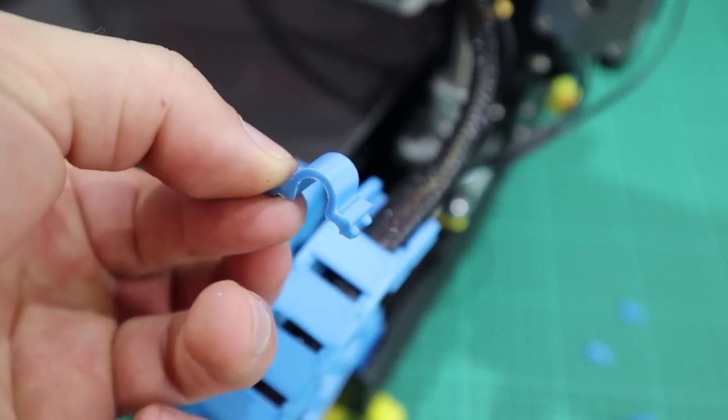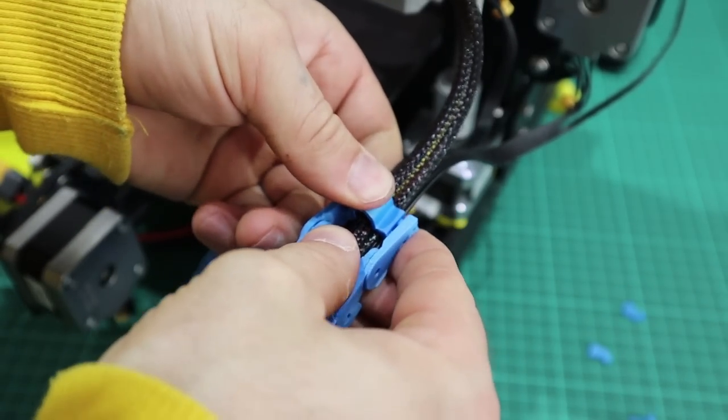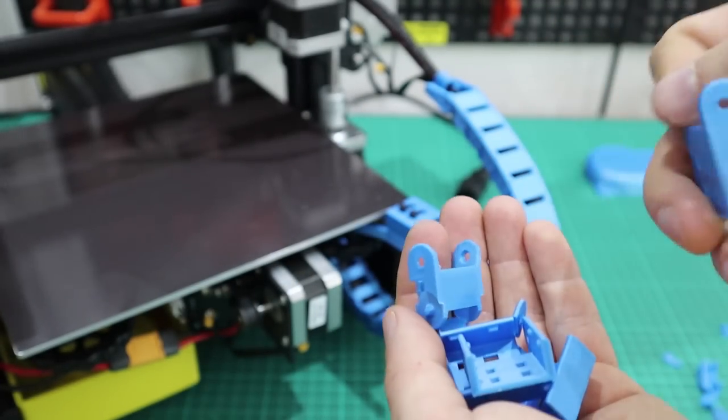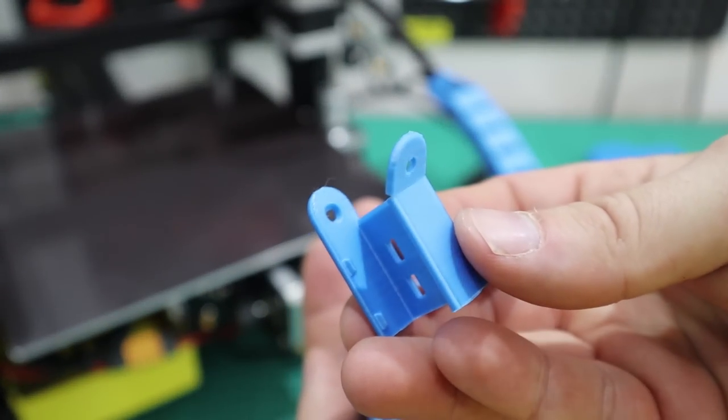On this section I'm also using 15 links and 15 cable retaining clips. Last but not least is the U-shape retaining clip — you could use cable ties instead. As I mentioned, I broke about five or six of these pieces. To overcome that, I printed at 210 degrees rather than 200 degrees.